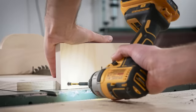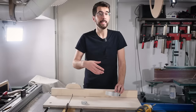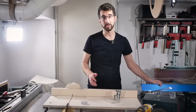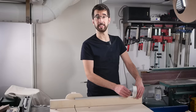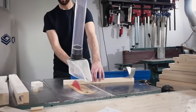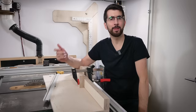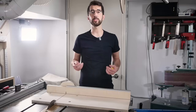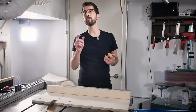Having T-track on your crosscut sled fence will allow you to quickly set up a stop — it's an absolute must-have feature in my opinion. My old sled did not have T-track on the fence, so I gravitated toward my miter gauge to utilize its flip stop. A stop on your crosscut sled fence lets you make repeated cuts of the exact same length. A flip stop is even better because it can retain its position but temporarily lift out of the way so you can square up one end of a board, then flip down the stop to cut the other end to length. You can clamp a block to the fence but it's more finicky, so you may as well install T-track now and you'll thank yourself later.